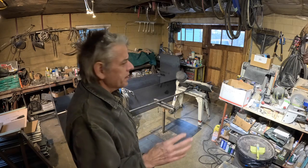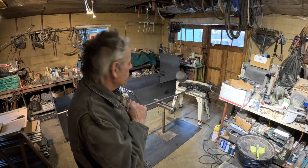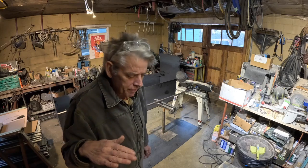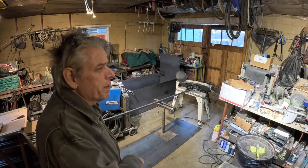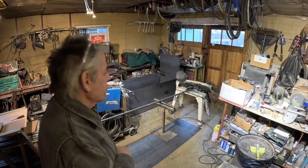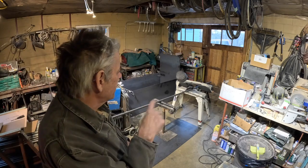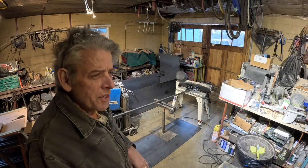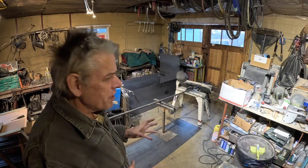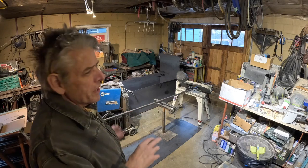I should go ahead and just cut 3 and put 1 in the middle. But it's got to be an 1/8 inch down from the edge, because that's where the mesh is going. I'm gonna build the bottom first with the mesh, and then 2 or 3 people will have to tip it over on the bottom, and then I'll put the surrounding, there's a little lip that goes on the top, and I'll weld the seams. It's so heavy and big, I gotta build it this way. I'm only one guy, and I'll have people come over when it's ready to flip.